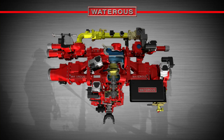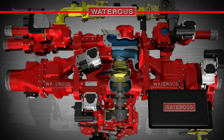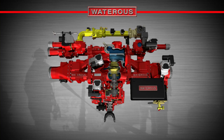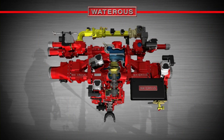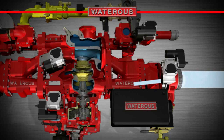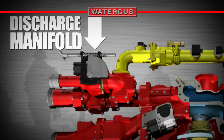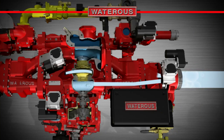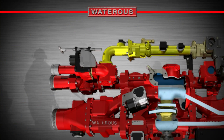Water enters the fire pump from the tank or any of the overboard pump inlets. In this example, we'll use the officer's side main pump inlet. This fire pump is a two-stage model, and for any CAF use, we'll run it in volume rather than pressure mode. As water enters the pump, 50% travels to the first-stage impeller, down to the transfer valve, and back up to the discharge manifold. The other 50% goes to the secondary impeller and directly into the discharge manifold.